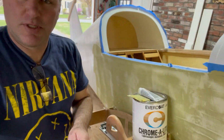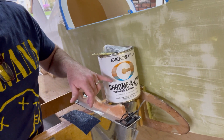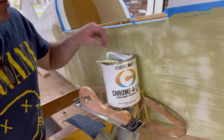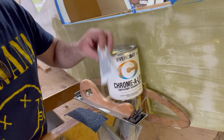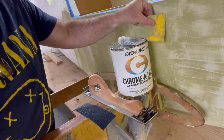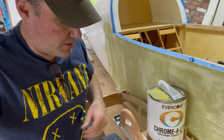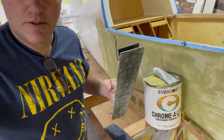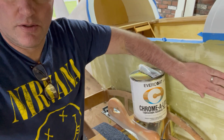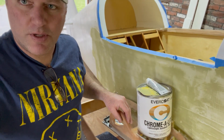What he suggested is using this material called Chromalite. It's basically Bondo — it can be used on cars but also on aircraft. It goes on pretty easily. You mix it with one to two percent of this hardener, and then it goes on just with a squeegee. After it dries for about 15 to 20 minutes, use a sanding block. You start with 36 grit to take off the first layer of the Chromalite, then do another sanding with 80 grit sandpaper.